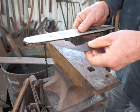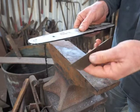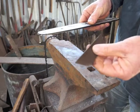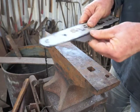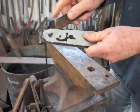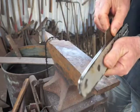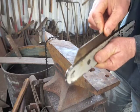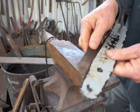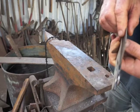First we'll do some hammering so that we can do our grinding and linishing after that. Here's a piece of sheet metal - it's actually saw blade steel - and it's just around the right thickness, the same thickness as the length of this chain link, about 1.3 millimeters. This is useful for cleaning out and will be useful for me to test the groove while I'm hammering it. I've tried putting the piece of steel in the groove while hammering and found that just doesn't work, so I hammer it without anything in the groove.